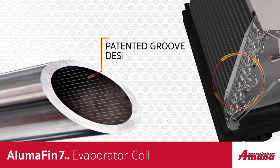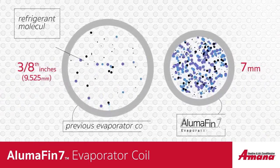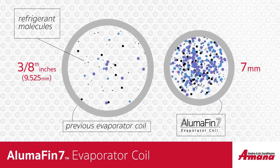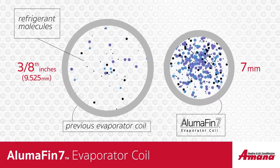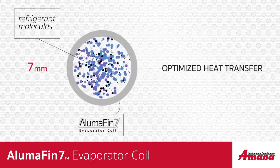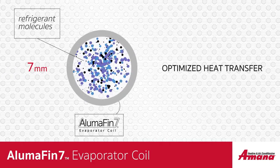The inside of the tubing contains grooves too. These grooves help to create a turbulence in the refrigerant as it passes through the small tubing. That's huge because this bouncing effect gives the refrigerant molecules more time to come in contact with the outside of the tubing. And that contact determines the efficiency and optimization of the heat transfer process.